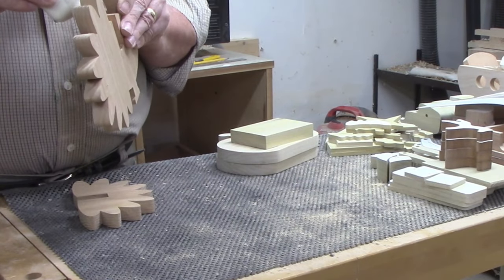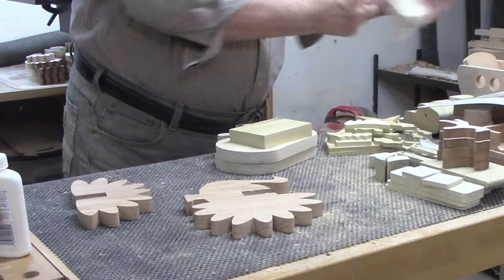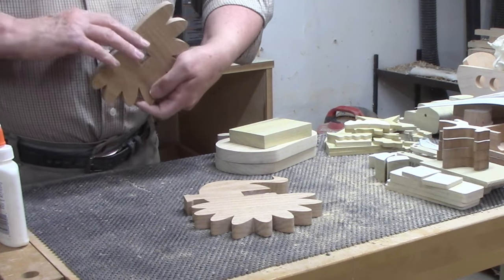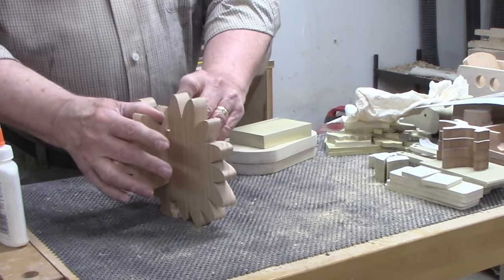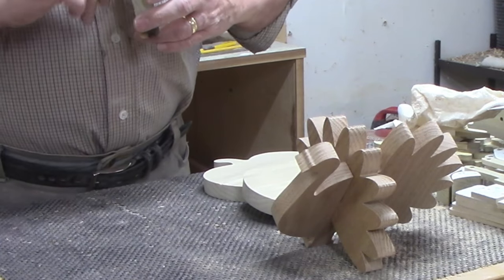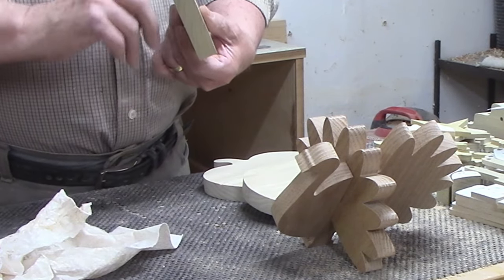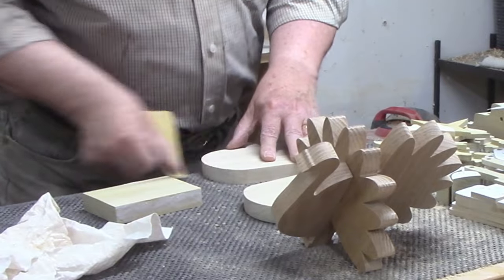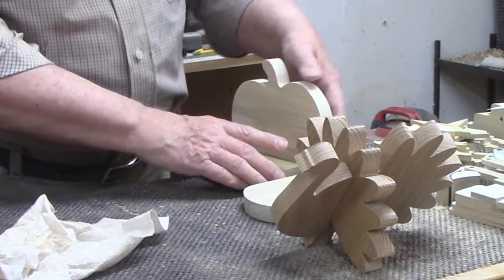The glue-ups for these two projects are both straightforward. I used a small bottle to apply white glue to the slots for the turkey parts and then used my fingertip to spread the glue around. Looking back, a glue brush would have helped me do a better job spreading the glue evenly inside those slots. I had no idea how to clamp the two pieces, so I just set them aside and let gravity do the work — four years of college and seven years of postgraduate study evidently didn't do much in helping me develop common sense. I used the glue bottle to add a bead of glue to each side of the spacer. As I went to add some glue to the bottom of one of the pumpkins, I noticed a small rough spot, so I tidied it up with a piece of 120-grit sandpaper. Then I added a bead of glue to the other pumpkin and placed the spacer in between them. It was easy to decide how to hold these pieces together while the glue dried — F-clamps, one on each side, would give sufficient pressure to hold the three parts together.